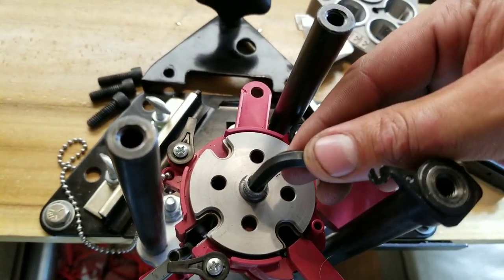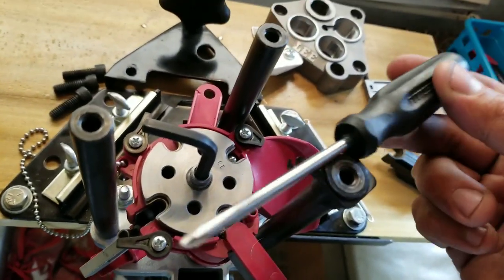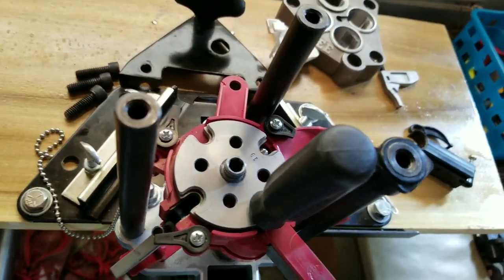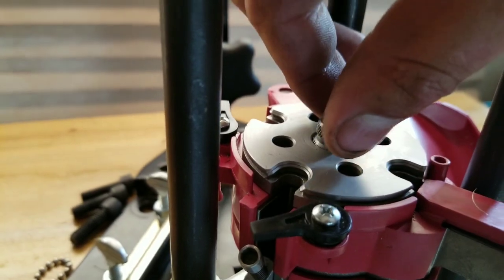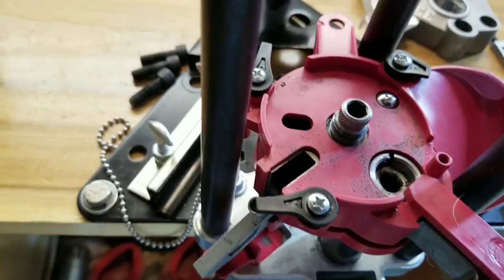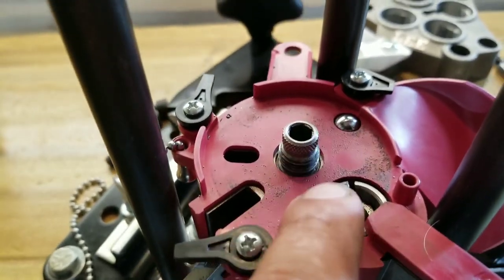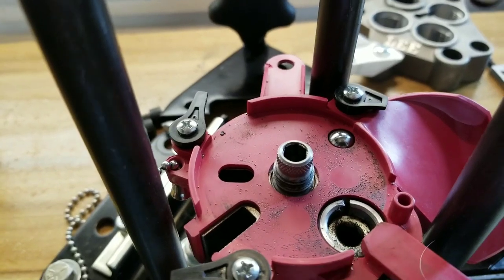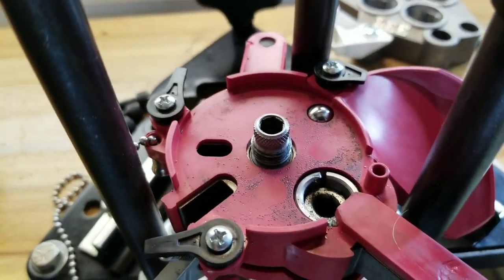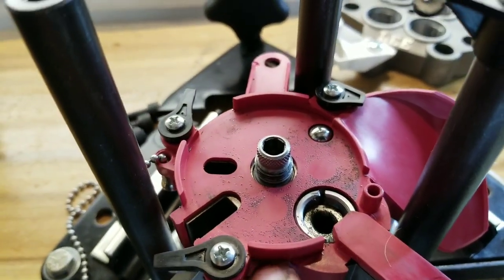I usually don't ram this down — it's pretty much just hand tight. If you're having an issue and can't get it off, get yourself a long screwdriver, throw it down there for leverage, and give it some muscle. These are knurled right here so you can give it a good twist and remove your shell plate. The only downfall I've seen — I've been using H110 for my 300 Blackout — is that when powder gets between the shell plate and the carrier assembly, it will indent the plastic. That was one of my concerns before buying this press. But all that damage is just aesthetics; it doesn't cause any issue with the function of the press.